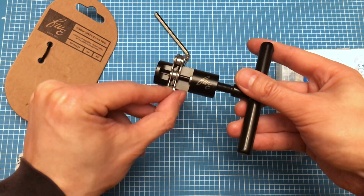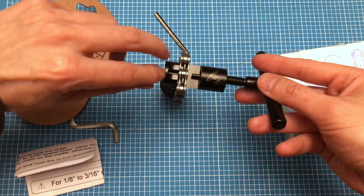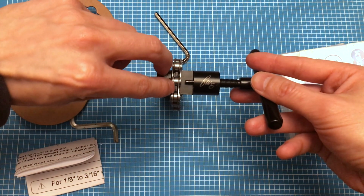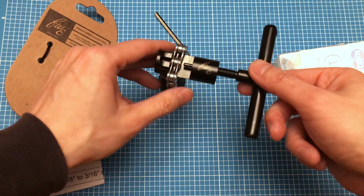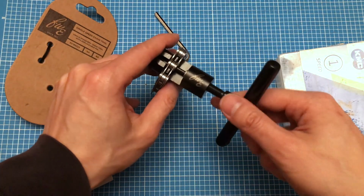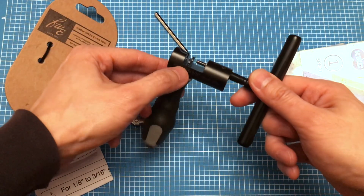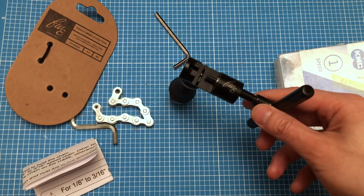If you have a very narrow chain, it won't make it to the wall. Let's just imagine the chain is more narrow, and it will rely on the cradle to hold it against the pin. And there's actually tremendous force against this, and so the cradle will break because it's just a thin piece of metal here. These things do bend and break if you use the wrong size chain.